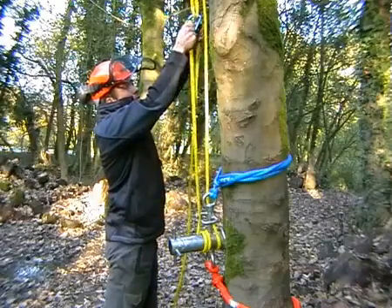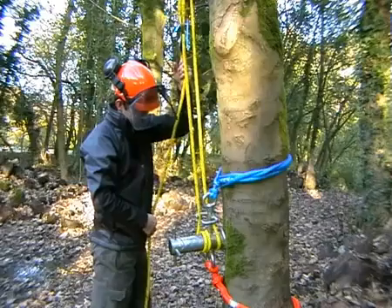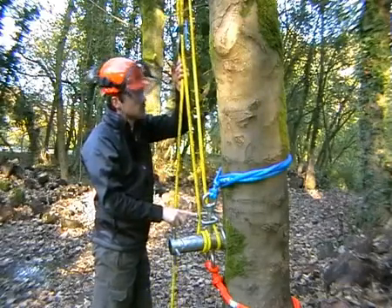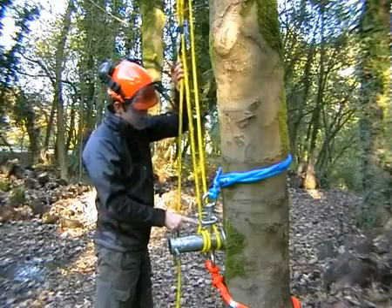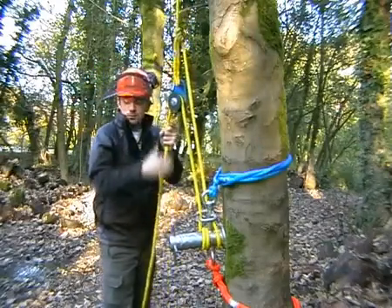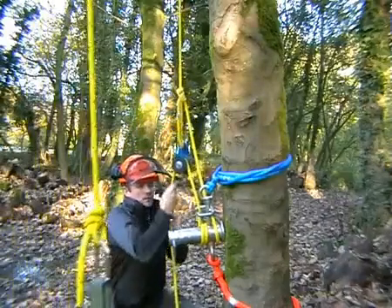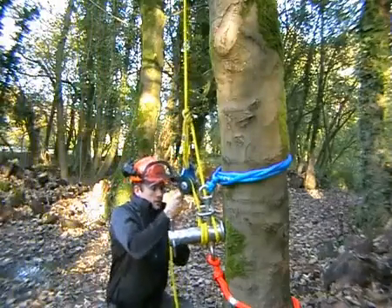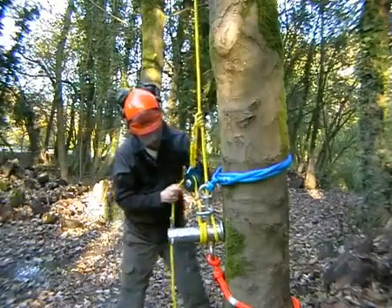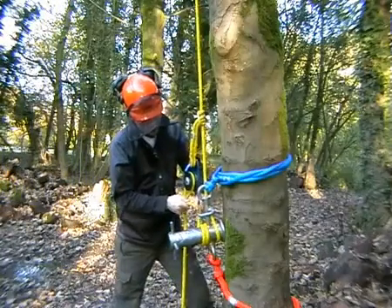Flip it over the pulley wheel. The rope is kept in position by this guide hook, so it's important that we keep the rope behind the guide hook. From there onwards we apply our tension. When you run out of line, just pinch the rope against the guide hook and put a turn on it for security.